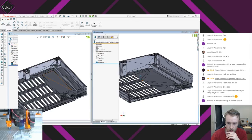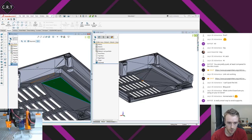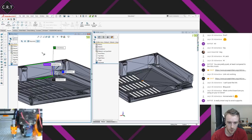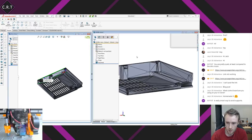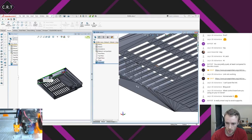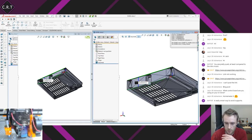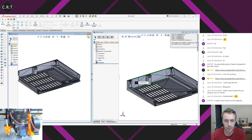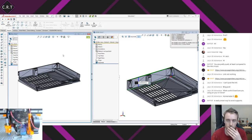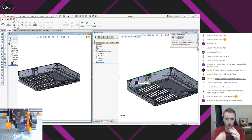Ah, it looks like the whole thing is shorter as well. Let's just take a quick measurement of that. So that's about, well, let's go, overall height 16 mil. This one looks more like 20 at least. Yeah, that's 20 mil. So they've taken 4 mil off the height. So obviously reduced print time because they're reducing the number of layers and reduced plastic. Presumably they've decided that the cables you can route such that you don't need that extra bulge, and so the door can be slightly thinner.